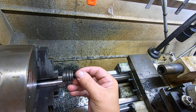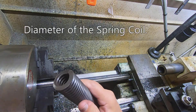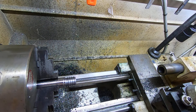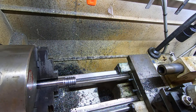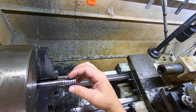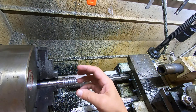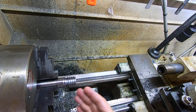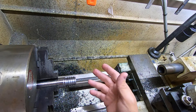That's what they were using, except it didn't work very well. So what I did was measure the diameter of this spring — it's a custom-made spring. I measured the diameter and cut a custom tool, just a radius cutter a little less than quarter inch. I measured the spring coils to see how many coils per inch it was and set the lathe to that. It ended up being five coils per inch, which is basically five threads per inch, and I just threaded this little section of one-inch 4140. I've already got the hole drilled through it and I'm going to tap it.